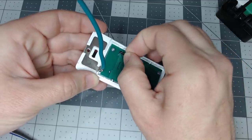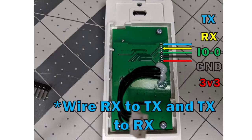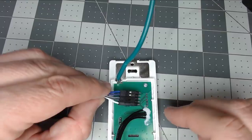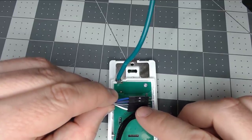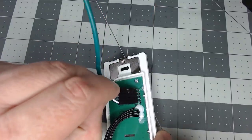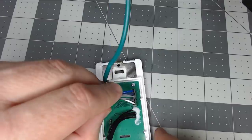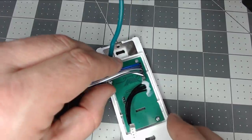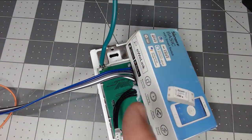Since these pins aren't labeled on this side, we'll show a slide you can pause to see the pin order. Once your pins are lined up, you'll have voltage, ground, GPIO0, RX, and then TX. Place them in the holes — a lot of times the pressure from being pulled to the side holds enough contact, but for good measure, put something on the side to ensure the pins have good continuity.